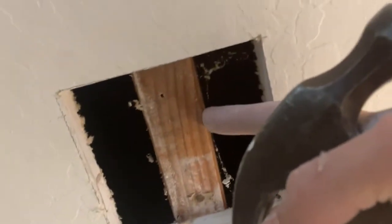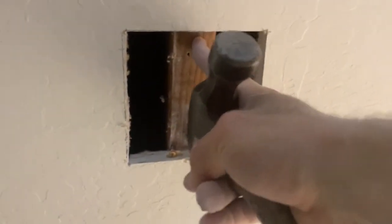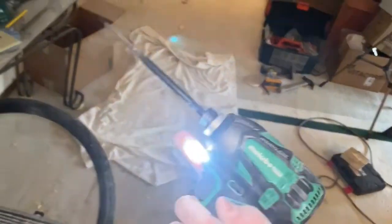I'm going to keep going down this road, drill a hole — it doesn't need to be perfect, just a little bit higher up — and when I put in the new drywall I'm going to put two screws in on the far edges so I miss the wire going through the center. I took my drill with a three-quarter inch spade bit, which is more than enough for this 14/2 Romex 14-gauge wire. Now all I'm doing is threading the wire through — it's super simple. You can see if I pull that, it's literally this easy. You just get it in there with two hands and stick it through the hole.